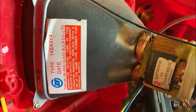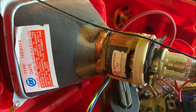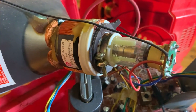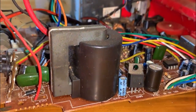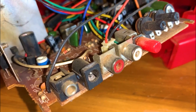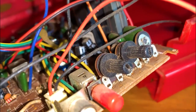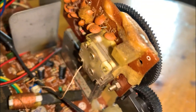In modern CRT monitors and televisions, the beams are bent by magnetic deflection using a deflection yoke. Electrostatic deflection is commonly used in oscilloscopes. The flyback transformer sends high voltage tension to the tube. The use of composite cables was the only choice to transmit analog signals. These old CRT TVs do have a built-in FM receiver that is made of tuner and audio amplifier.